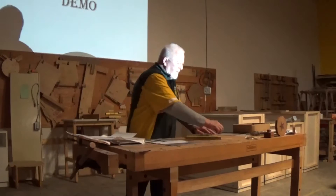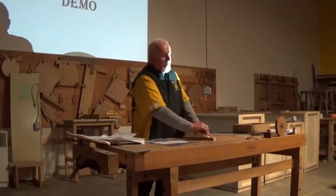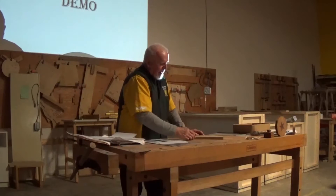If you come on Saturday, you need to bring two boards. Depending on the size of your lathe — if you can turn a 12-inch bowl, bring two 6-inch boards 12 inches long; if you've got a 10-inch lathe, two 5-inch boards 10 inches long. We're going to show you how to cut them on a bandsaw. Even if you don't have a bandsaw, you need to learn how, because you're going to want one. You put the two boards together, take a compass, and draw concentric circles, making the circles as wide as the board is thick.